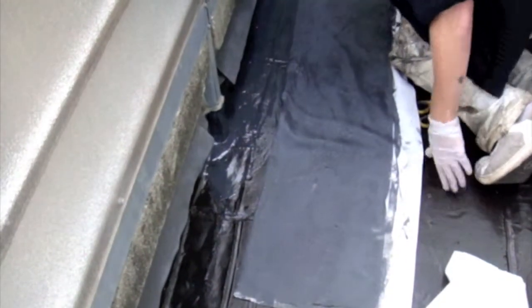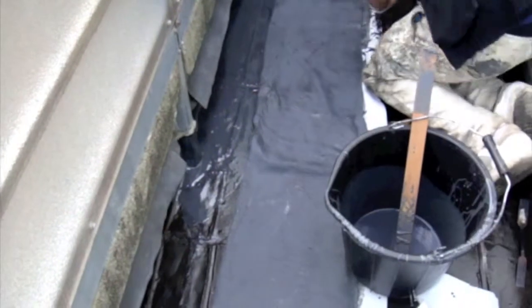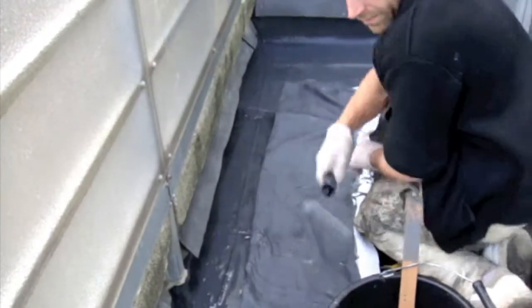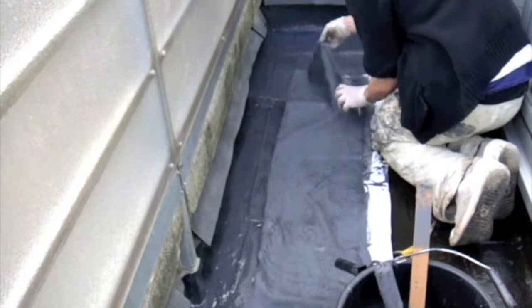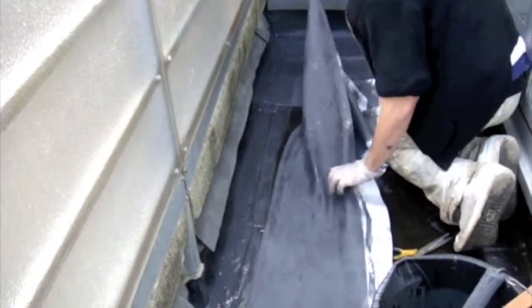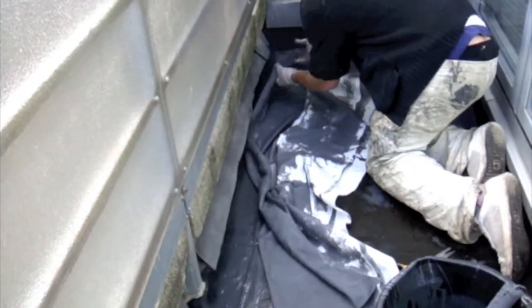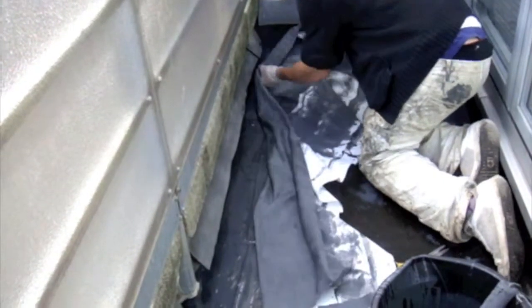As you can see, it's very difficult conditions here — it's not very wide and there's nowhere really to work. But this resin oozes everywhere and we can get it in areas where you normally wouldn't be able to get other materials. This fleece has already been impregnated with the material and we can ooze it up underneath the flashing quite easily. We can also get it around the legs of the railings.